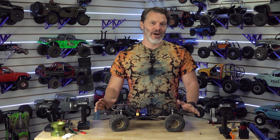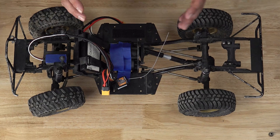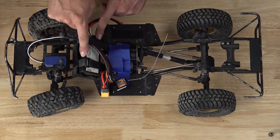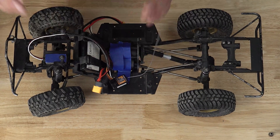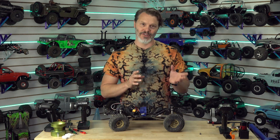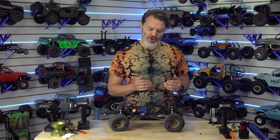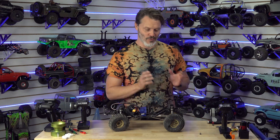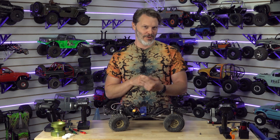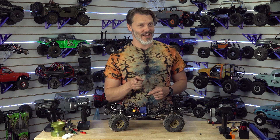On the other hand, I was also experiencing a lot less stalling than I'd normally feel. We are still limited by our battery's ability to produce amps, by our wire's ability to shuffle those amps through, and also by our ESC — in particular, whichever phase side MOSFET is switching. For any particular amp draw, it's going to have a certain voltage drop. The more voltage drop, the less torque you're going to be able to make, because without the voltage you can't produce the torque, even though torque is made by amps. If your voltage doesn't get in, you can't pull as many amps. Your amps make torque, but your amps also make heat, and your MOSFETs get really unhappy when they get hot.